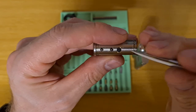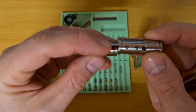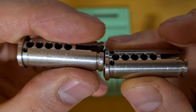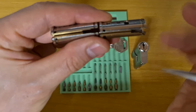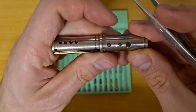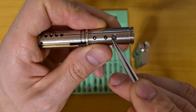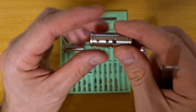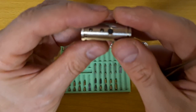as I said, it's a more security rated one, and it adds a check pin here. So the overmilling is still there. You can see it very well. In the exterior, there is some more drill protection, but picking relevant is this guy here. It's a check pin and it acts as a trap. So in the normal position, it doesn't do anything.